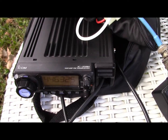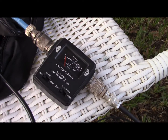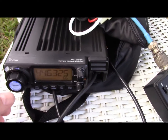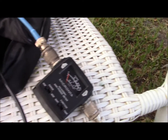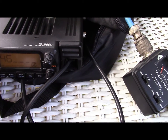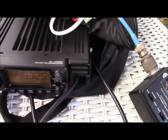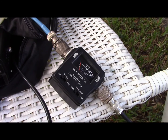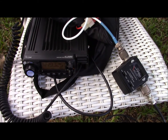We're sitting here at the mid-band, 70 centimeters, and on 15 watts of power, let's see what our reflected power is. At the end of the 70 centimeter band, as you can see we get full coverage, and that's as constructed. Gotta love quarter waves and the broadband width.